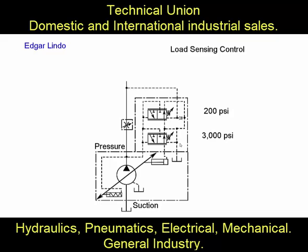The pressure compensated control has a heavier spring. It limits the flow to maximum system pressure. For this example, we're going to say it's 3,000 psi. The resistance of this spring is going to be 3,000 psi, and that is going to be the maximum system pressure.